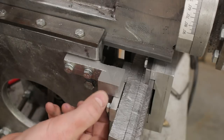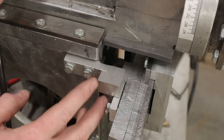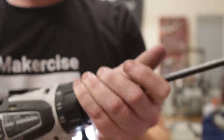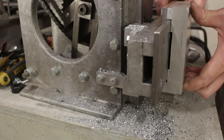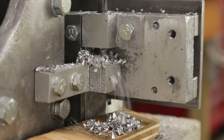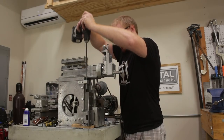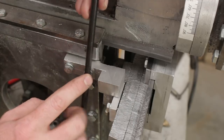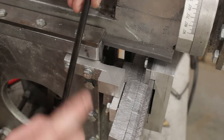After increasing the drill bits a little bit at a time I will eventually need to transfer these markings to the bottom to ensure all three pieces are aligned, and for that I will use one of my longer drill bits. That should get us all the way through and ensure these three holes are pretty well aligned, then I'll have to enlarge them a little bit more — to the tapping diameter for this block and a through hole for the upper and lower ones.